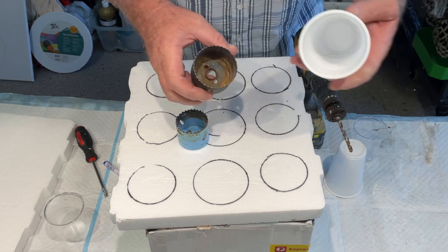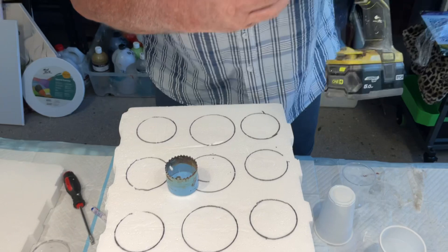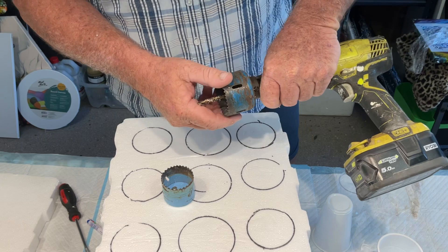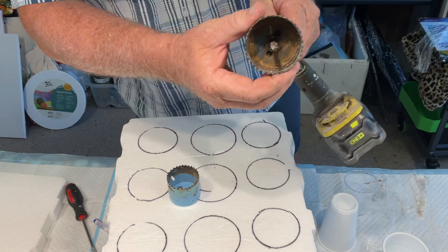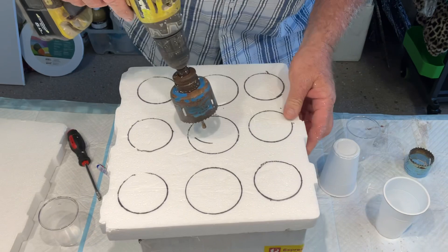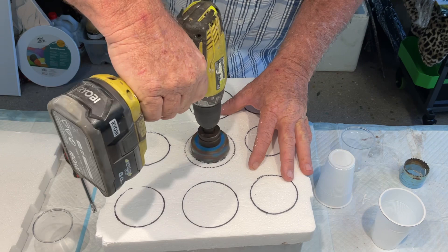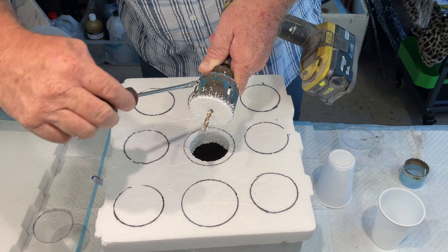It's actually going to sit in a little bit further but that's the best I had. On these hole saws, you screw them on until they're tight and then back them off a little bit. Push this through and push the pins into the end — there's a spot where the pins locate, but the hole saw shouldn't be tight otherwise you can't get it off. I've got it basically central. Starting roughly in the centre, just slowly put it on low speed and drill through.